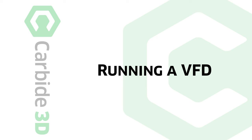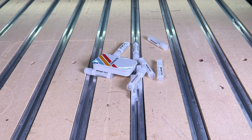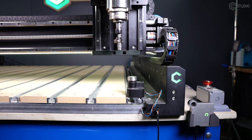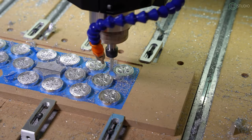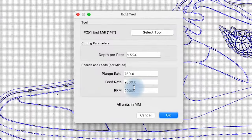How about running a VFD spindle? VFD spindles exclusively use ER-style collets, giving you maximum choice in tooling. Quality-of-life improvements start to shine immediately. Automatic on and off signals mean you don't have to click a switch or navigate a pop-up menu each time a tool change is required — your spindle turns off and the CNC automatically moves to the tool change position without your intervention. Additionally, the VFD sends automatic RPM changes based on the settings specified in your CAM setup. If you want a certain RPM for a roughing toolpath and a lower RPM for a finishing pass, the RPM is automatically adjusted without pausing the program.